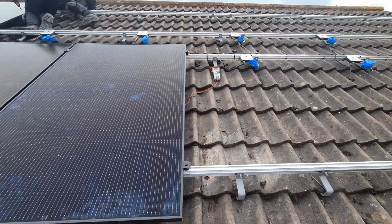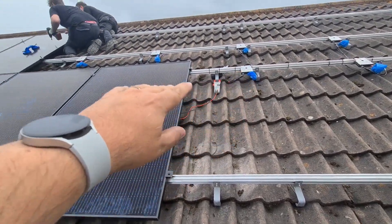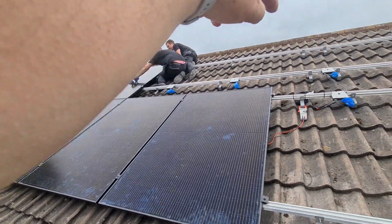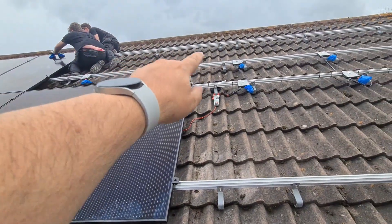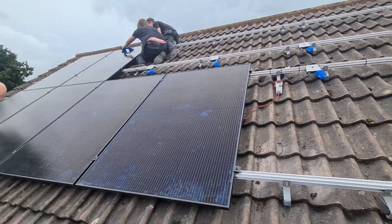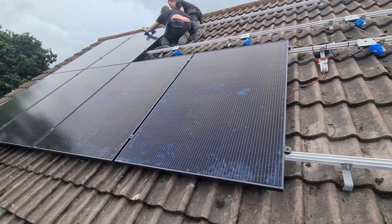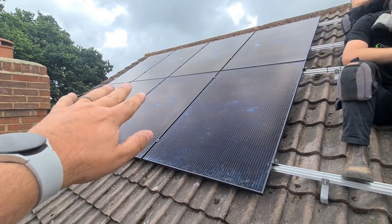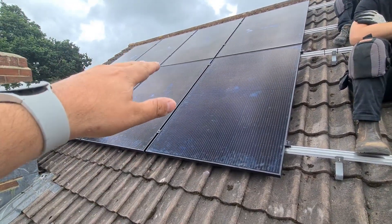Stuart may even give us a walkthrough of what this system all comes together like, but you can see we've got the SolarEdge voltage optimisers. The guys have got the rails on this side of the roof already and there's another six panels going on the other side. These SolarEdge optimisers will let you know which one of the panels has gone faulty if one of them goes down — it's a really clever system. So you can see we've got a few of the panels on here now; there are eight of them on this side forming part of a little system of its own.